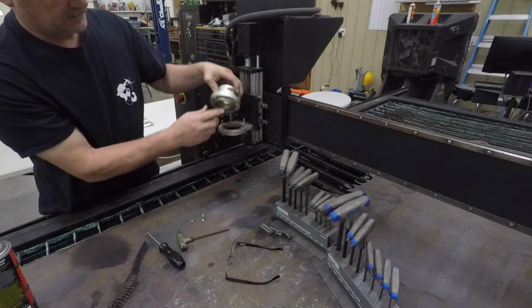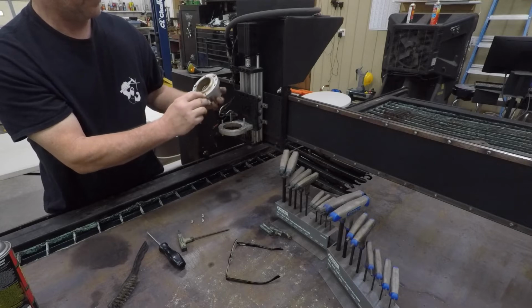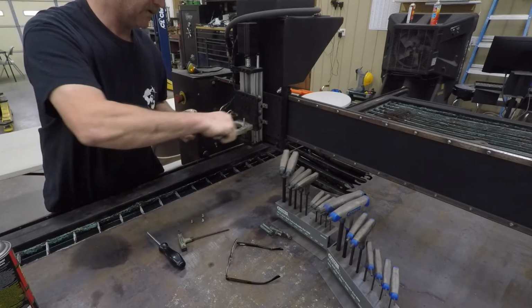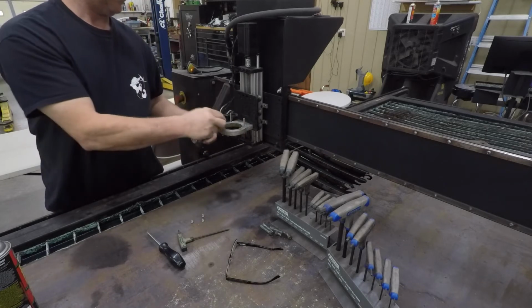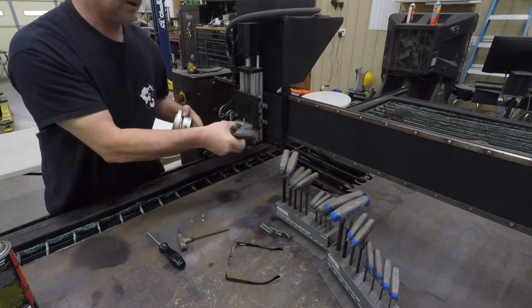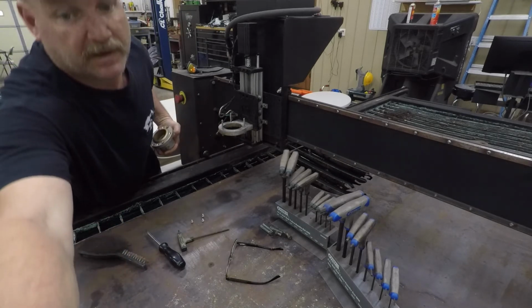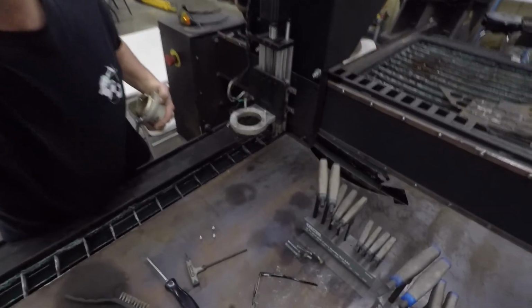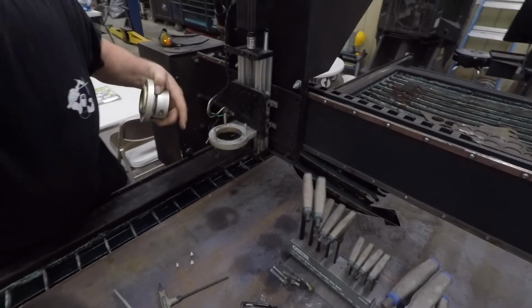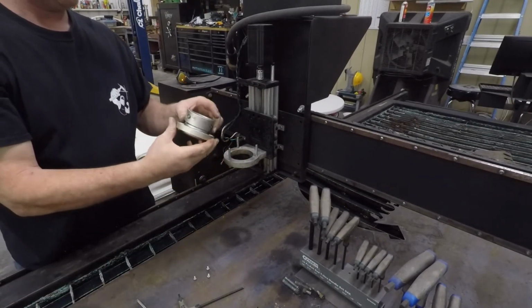Okay, and this I assume will just come off of here now. So you got these little contacts that touch this. So I was just planning on taking a wire brush or something, and maybe I'll have to pull them screws out and just buff that really clean. You can see the aluminum is kind of corroded up. Can't really get you any closer. The battery's low on this camera, but I've got you plugged in. But this aluminum's getting a little corroded. I'm assuming that's kind of what's causing this issue.